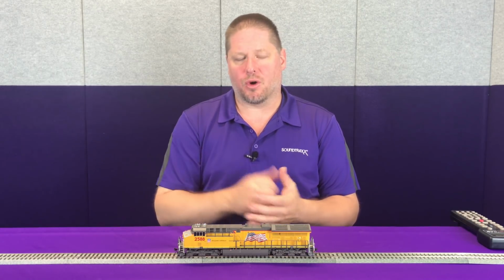The pressure at which those waves hit our ear is going to be interpreted as the volume. So this is kind of why we recommend using a large speaker in our decoders, because the larger the speaker, usually the wider travel that the speaker can do. Also, the larger surface area is able to create more pressure, aka more volume.